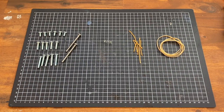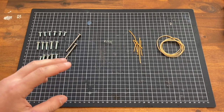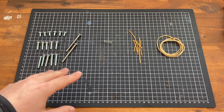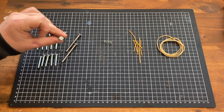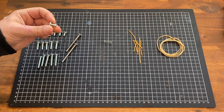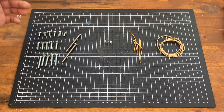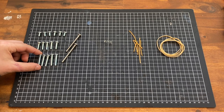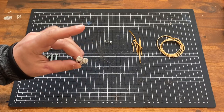This is the hardware you will need. First up, we have M5 screws — you can get these from Home Depot or from McMaster-Carr. The quantities I'm about to show you are for the pistol size build; for the axe or full-length musket, I'll show you where you need some extras. These are slot head screws — you can use whatever, but I think these look prettier. You'll need six 10mm, five 20mm, five 30mm, and two 60mm screws.